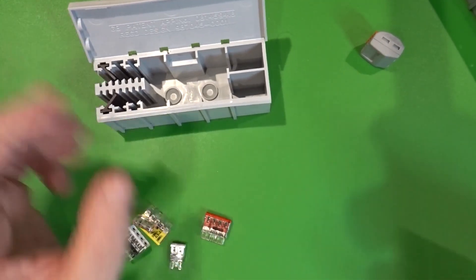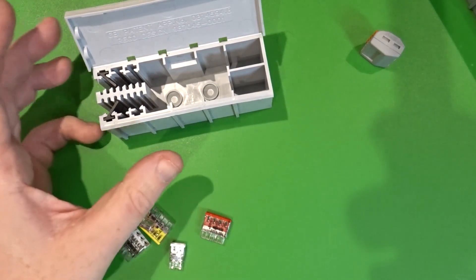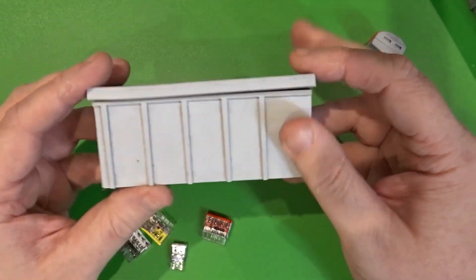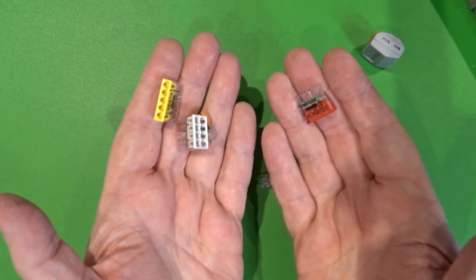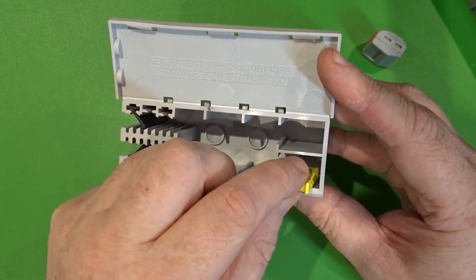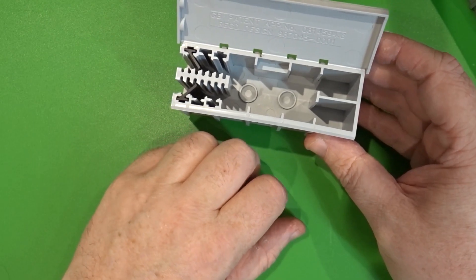The primary concern here is maintenance-free compliance. If you're using an old WAGO box that has the maintenance-free symbol and you plan to install the newer slim-profile devices, the instructions in the lid will tell you that these enclosures need those inserts to reduce the space and avoid any movement. If maintenance-free is not a requirement, there's not too much concern, but the new 2214 box does have maintenance-free compliance built in.